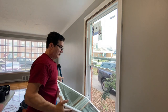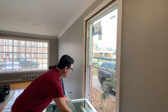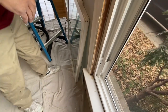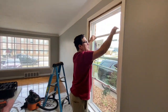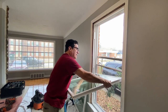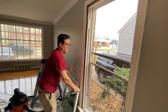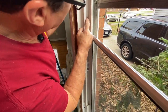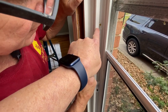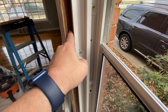We pull the clips, lift, and the lower sash comes right out — then lower it and lift it out of the top. We do the same thing on the upper one: get the clips on top, bring it out, lift one side, and it comes right out. You can see the screw here that allows us to put the shim in. It's not the tension spring screw — it's that one. There's a piece of hardware on the other side that tightens up to the jamb as you screw it in.